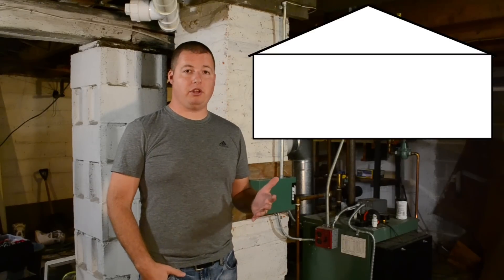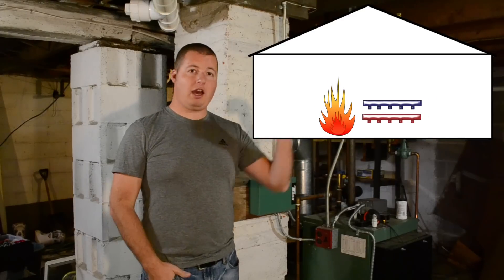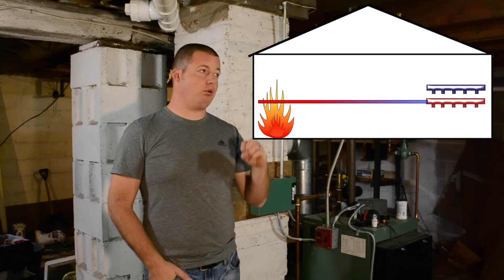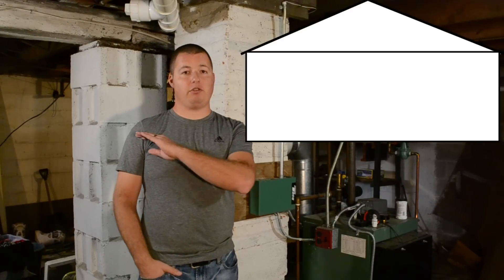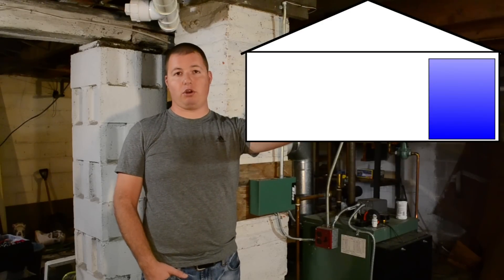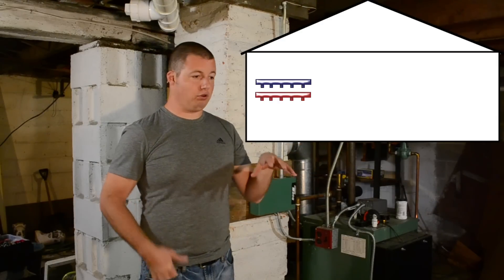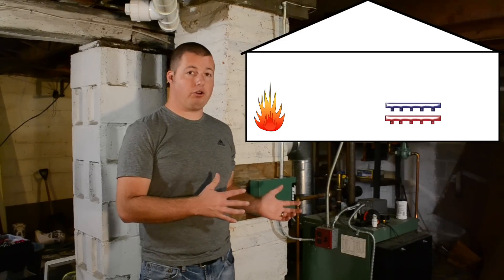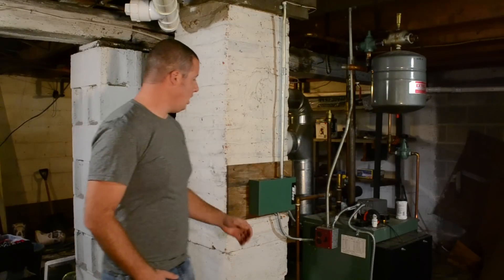When you're thinking about where to put this, keep in mind you want to keep the distance from your heating source and your PEX manifold pretty close. If your heating source is at one end of the house and your manifold at the other, the heated water has to travel all that way before reaching the zones. You want to keep them as close together as possible, towards the center of your house, especially your manifold — because if you have a cold room far away and the hot water cools down before it gets there, it won't be effective. Luckily my furnace is close to the center of my basement, so that works well for me.